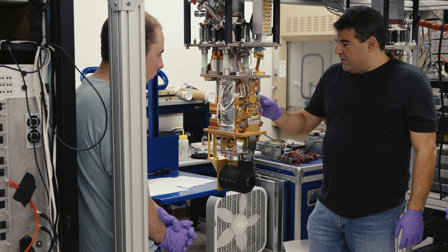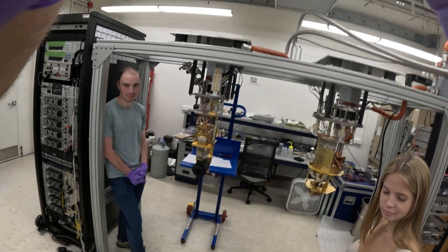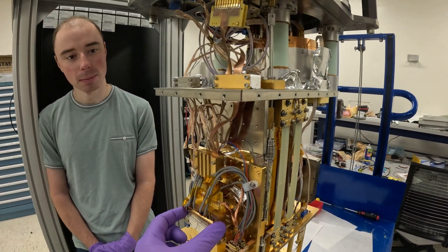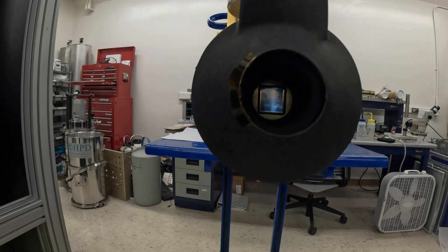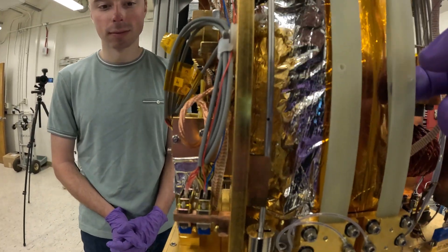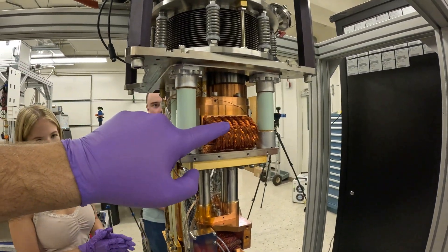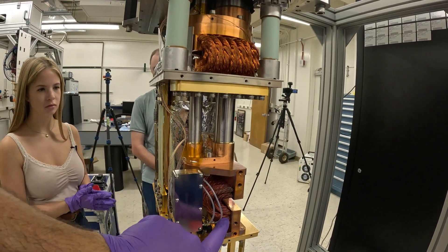There are some other interesting parts. Going over here you can see the G3PO connectors, the flexible cables, the 4 Kelvin amplifier block, and the flex cables. You can even see inside the array in the center here. These are high-temperature superconductor leads — they bring the 10 amps the magnet needs in without generating any heat. On the back are thermal straps that connect everything to the pulse tube for good thermalization — these huge beefy copper straps.